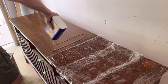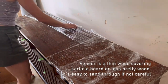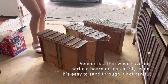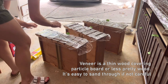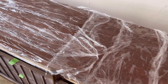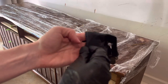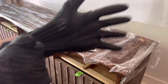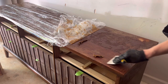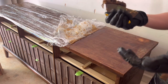For the top portion of the dresser, I'm going to be stripping it down to raw wood for that dipped look. But because this is veneer, I'm going to be extra careful and first use a chemical stripper to remove the finish with less sanding required — less sanding equals less of a chance that I'm going to blast through the veneer. If this was just a full solid wood top, I would start with an 80 grit, move to 120, and then 220. This product really isn't environmentally or human friendly, so be sure to use all of your personal protective equipment and contact your local waste management company to see the safest way to dispose of it.